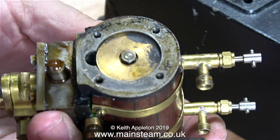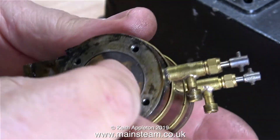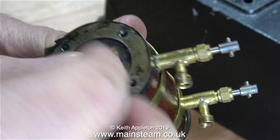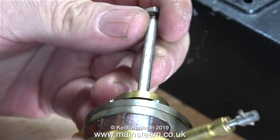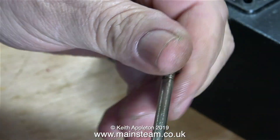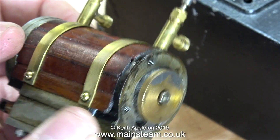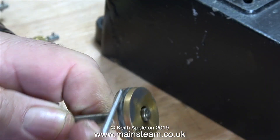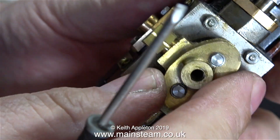I'm wondering what the piston fits like. It slides up and down in the cylinder a little bit too easily, and yes, there's a bit of side play too. Sometimes these engines have piston rings made from cast iron; alternatively they can be fitted with a silicone O-ring as a piston ring, and sometimes even soft packings, which is just graphited yarn. There's nothing wrong with soft packings for pistons in steam engine cylinders, but as a general rule if you're using soft packings the piston has to be a good fit in the cylinder.